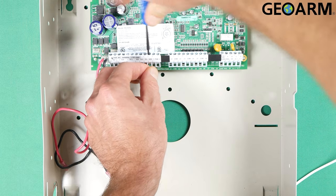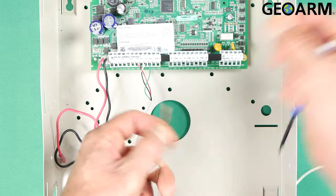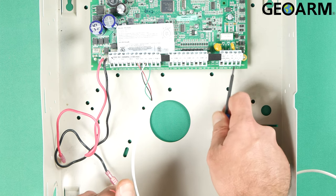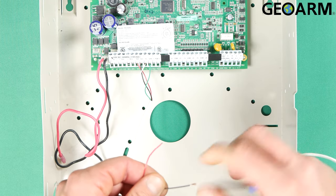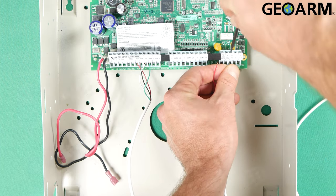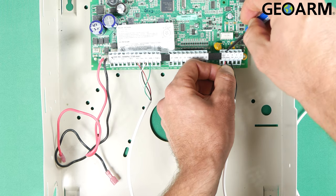Once you have those connections in place, we're going to move on to our phone terminals, which is this strip of two conductor. You're going to go all the way to the far right. There's going to be ring, tip, R1, and T1 — these four terminals. Make sure there are no wires in those terminals at this point; this will be the only thing wiring into those four spots. The black wire we are going to put into tip, also labeled B on the strip — so tip B. And then we're going to take the red wire and that is going to go to ring A. Once you do that, tighten it in place.